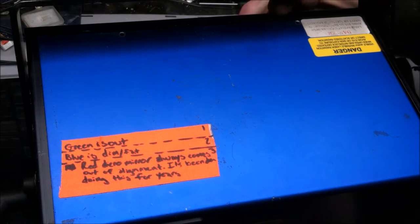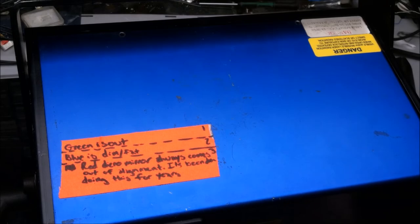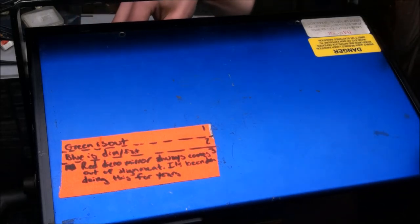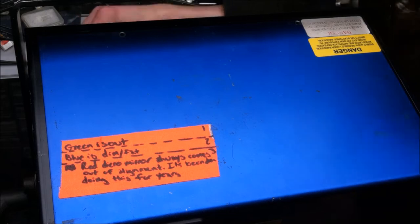Nope. Typical problem with the green DPSS laser heads like this. It's because a pump diode uses so much current that the control systems don't handle it quite as well. Large DPSS laser heads are notorious for that kind of stuff.